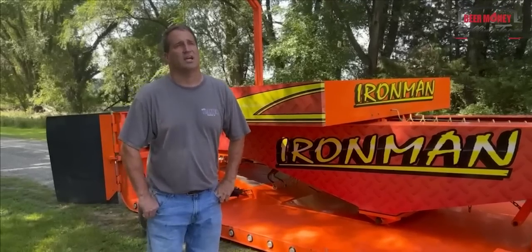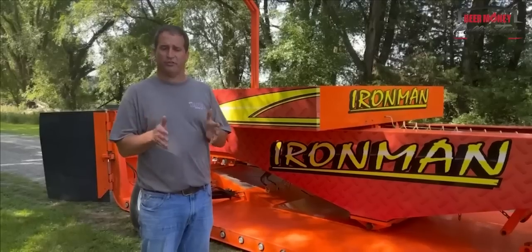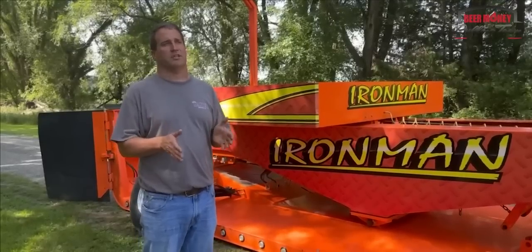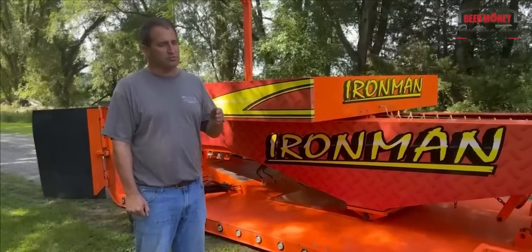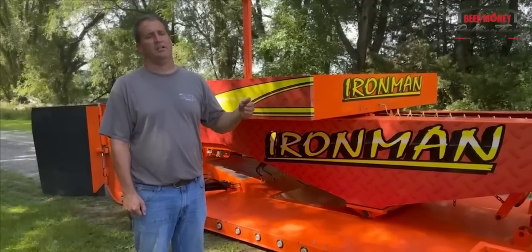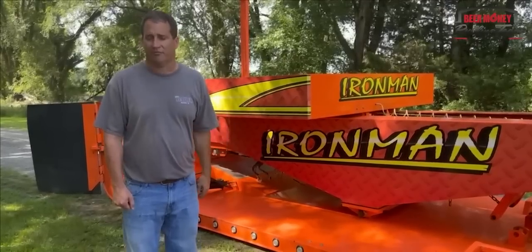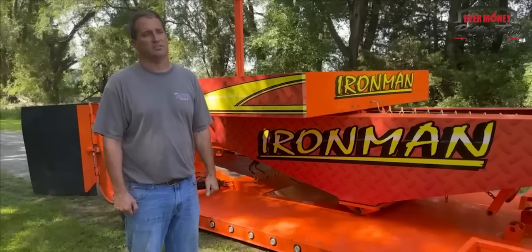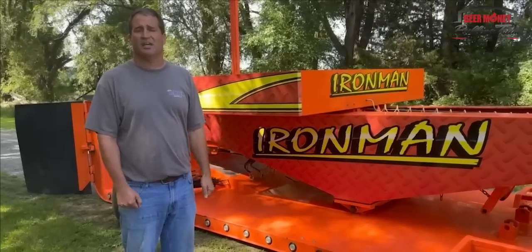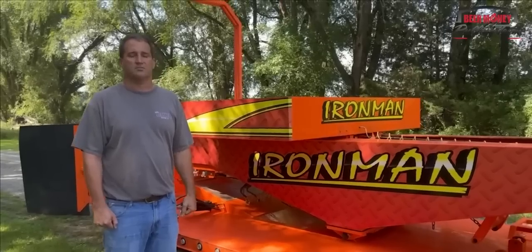And I've always said that if you take the sled and you run up to 32 miles an hour and you have your sled set for 320, we generally don't have a problem. But for every mile an hour over 32, it takes you another 10 feet to get the vehicle stopped with the same weight in the sled. It's just 32 seems to be that magic number. If we could hang right there, it's a manageable thing.